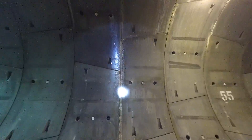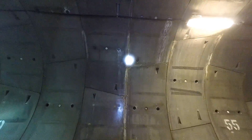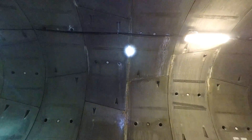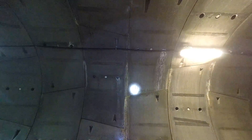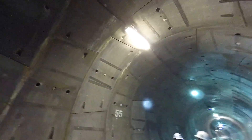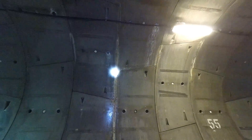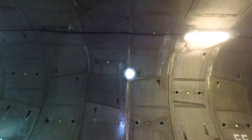During the injection of this gap, we noticed that a lot more material was getting pumped in than expected. The reason was that there was quite a large void, probably at around the 11 o'clock position. We started to notice that all of the bolts on either side of the ring, going as far back as my flashlight is pointing, were leaking water — and then polyflex started to come out, meaning that all of the voids were completely filled with polyflex in the course of doing that.